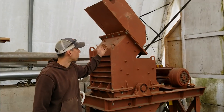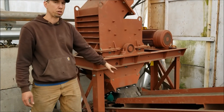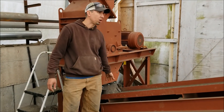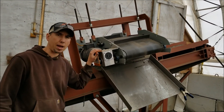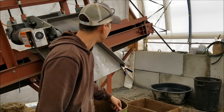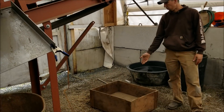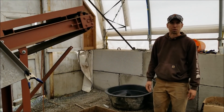We're going to be running it through our 24 by 16 HD hammer mill here. It has a 2 inch by 3 inch screen in it so it'll crush it all up, discharge it onto this conveyor belt, it'll run up under this cross belt magnet, it'll pull out any steel or ferrous material into this barrel, and then all the non-ferrous and non-magnetics will come off the end of the belt and right now we're going to catch it in this box. So we'll get this thing fired up and we'll see how it works.